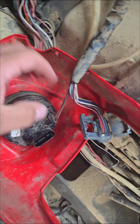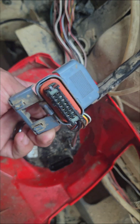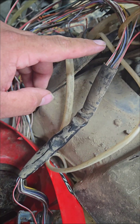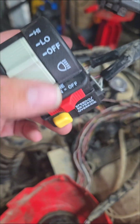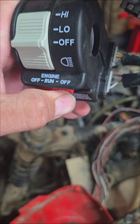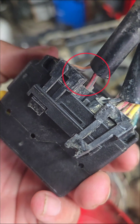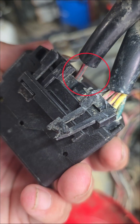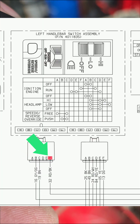What I've done is saved you hours of stripping down wires and chasing them. The power for pin 2 goes through the harness up and around, and goes through your handlebar safety kill switch — off/run/off. What you're going to do is check voltage on this black and red wire here. Make sure when the key is on you have voltage there, because that is what sends the power through to your speedometer.